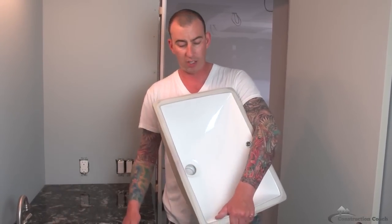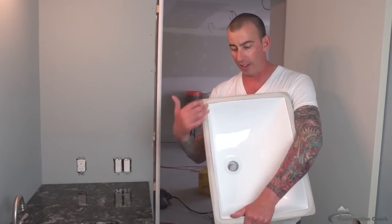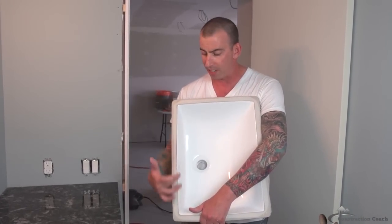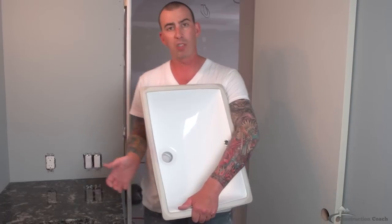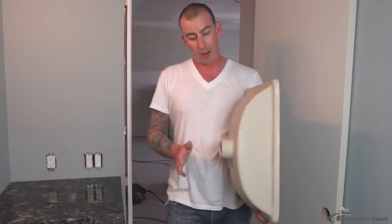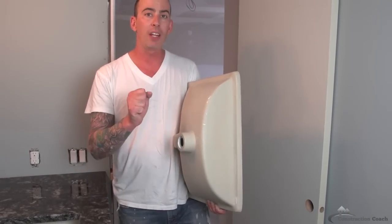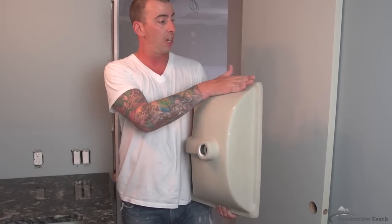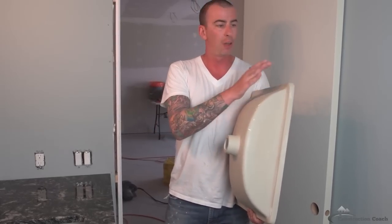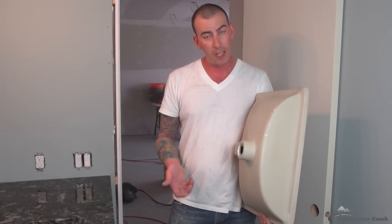In this situation I'm doing an undermount sink. I'm just gonna dry fit it to make sure that my granite hole was polished to the right size to hold this sink. This hole is smaller than the sink by a little bit so that there's a reveal around the inside. I've just got to put a bead of silicone all the way around the top surface, then use some really sticky tape to hold the sink up into position. Underneath the sink, I'm gonna cut a block of wood from the drain down to the bottom of the cabinet and wedge that in. Then I'll put some epoxy around this rim in a few locations to help the sink bond right to the underside of the granite countertop.